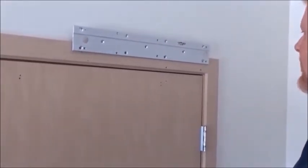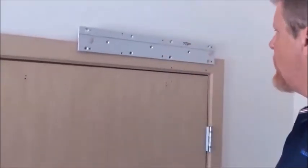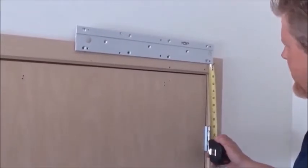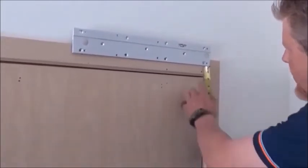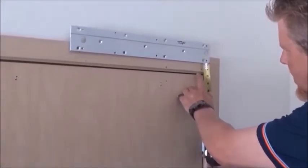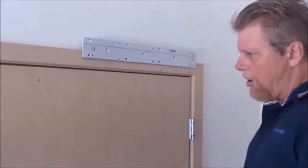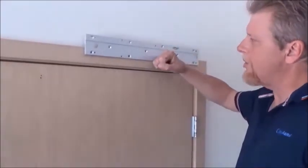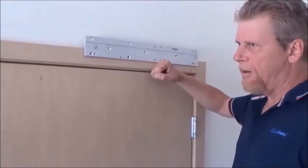Page four diagram also specifies one and three-sixteenths above the door. I went from the bottom of the casement with a pull arm — that's critical because the motor output shaft has to be above the door or the door is not going to open.